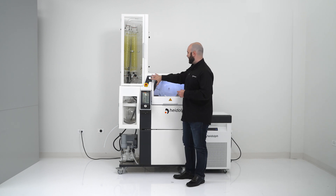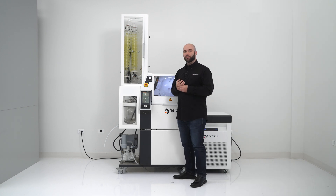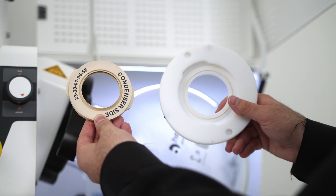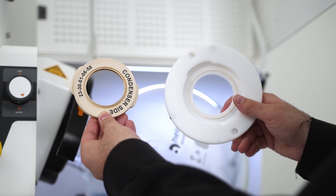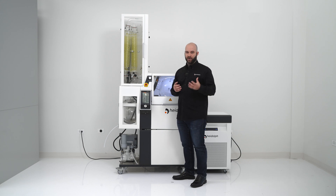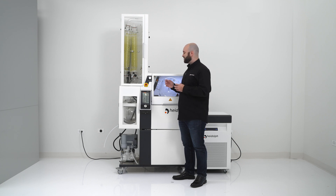Inside of our drive over the vapor tube, we also have a double-lipped PTFE vacuum seal working in conjunction with an adapter that has FFKM o-rings. The PTFE and FFKM are incredibly solvent resistant, meaning your vacuum seal will last a very long time without needing to be replaced while still holding an incredibly tight vacuum. That's thanks to the two points of contact on the vapor tube from that double-lipped seal.